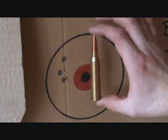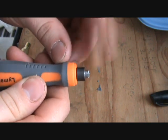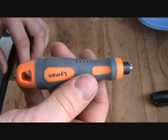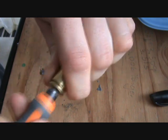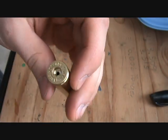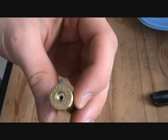Here's a loaded round for size comparison. So earlier I said I'd talk a little bit about the Lyman Primer Pocket Uniformer. I picked this up a couple weeks ago and I'll show you how it works. It's got a SAAMI specification collet that will cut your primer pocket to exactly the right depth and shape it's supposed to be. It makes seating primers a lot easier and makes cleaning the primer pockets go a lot nicer. It does take a little bit of pressure and there will be some shavings coming out — that's to be expected. Nice, shiny, and clean. You get the same seating depth each time when you push your primer in, and it makes cleaning them a lot easier.